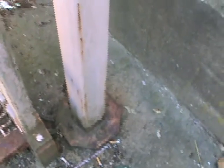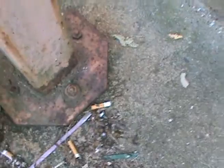Okay, so say this is a building, that fire escape with legs to the ground. Here we have the bases. The bases need to be cleaned up. Zoom out. Some of the bases need to be cleaned out. You can tarp all the way about 6 inches from the ground, to keep it from deteriorating, because snow, water, and debris will cause this to get damaged.